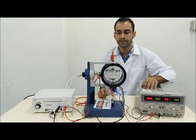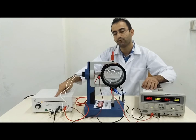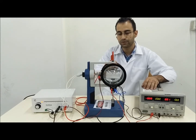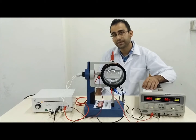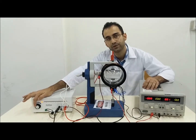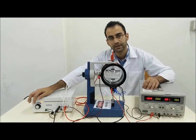When we switch on the high voltage supply, the fixed 6.3 V is connected and you can see the heaters lighting up with a little bit of light reflecting on this window. As we increase the high voltage we should be able to see the electron beam on the screen. Increasing the high voltage knob, you can see there is a red segment of light on the scale — each small segment is equal to 250 volts.